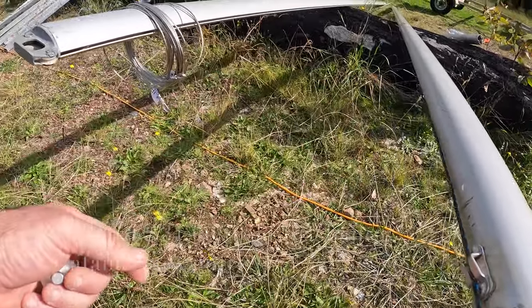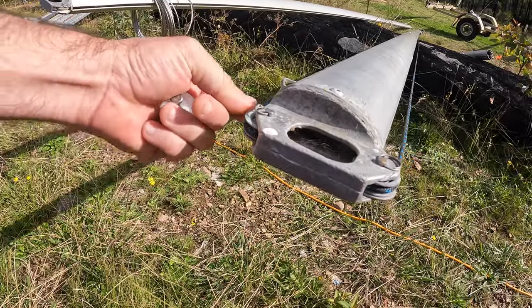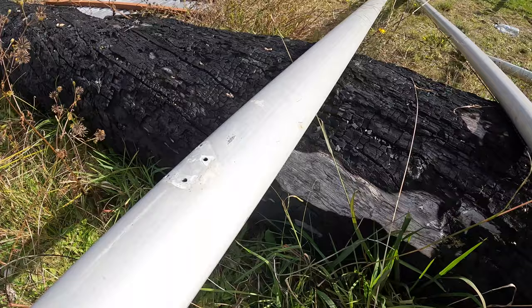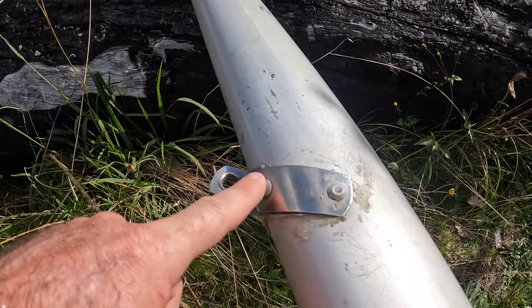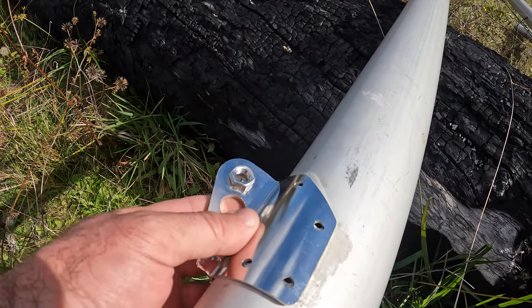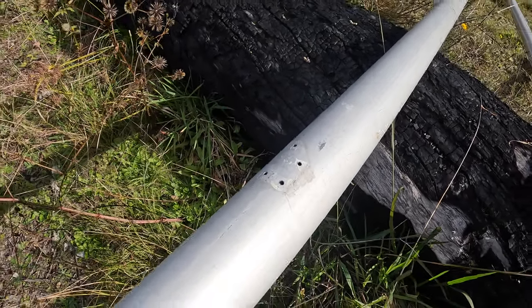This boat doesn't have a halyard, so I've got a new one for it. There are two halyards — this one has a rope halyard and I'm just changing it to a wire halyard. There's nothing wrong with the sheaves on this mast — they look fine, no cracks or anything. Also, the lightweight mast doesn't have a hound. The hound is this bit here where your stays connect. This is an older style with just two rivets, and this has the newer style with four rivets either side.